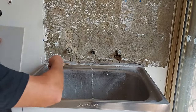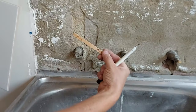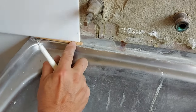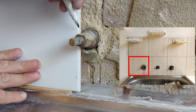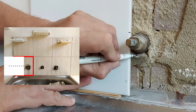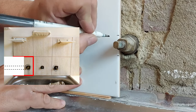To mark our hole dead center, we start off with the whole tile — obviously the one at the bottom, makes sense. We need a bit of a gap off the surface of whatever we're working off, and to keep it consistent I've cut some pop sticks and glued them together. We're going to pop them there and place that across, bring it across to where our spindle is. I'm going to mark the absolute bare minimum — even though the hole we'll make will be larger, I need to know the minimum. It's a permanent marker, but it doesn't matter if you've got it wrong — just lick your thumb, wipe it off and she's gone.